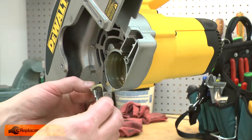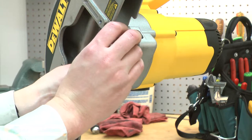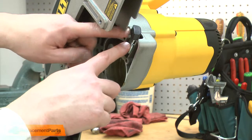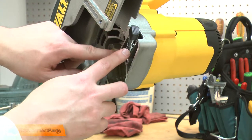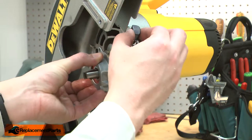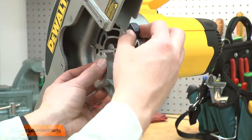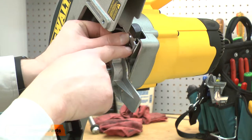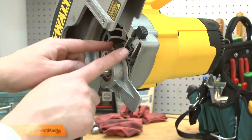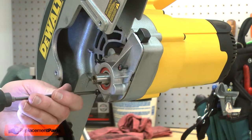The easiest way to do it is to slide the felt seal back into the slot in the housing. At the same time, I'll make sure that the spring is sitting on the casting just above the felt. Now I'll align the spindle with the housing. And once the spindle is inserted far enough into the housing that the lock pin is clear of the gear, I can compress the pin and slide it into the housing. Now I'll rotate the spindle housing up and into place and secure it with the screws.